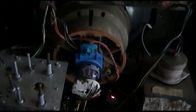So what's going on here? I don't hear high voltage or anything. There's high voltage there. I don't have anything on the screen here. Well, I'm going to say the yoke is not configured the same. Huh. So what do I do with this? Well, you know what would actually help is if I plugged the yoke into the right socket and the convergence into the right socket. I don't know where my brain is right now. It's not on TVs, that's for sure.